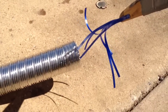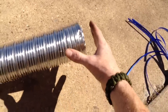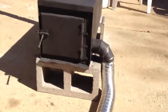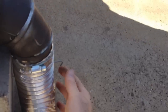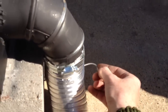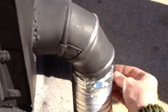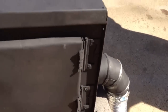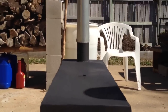There we go, a little bit. Let's see if I can feel it with my hand — yeah, you can definitely feel it. I mean, it's not going too fast, but it's sucking in air just a little bit. Now, here we got one problem: the top of the wood stove is smoking. That's not good. First thing we're going to do is come over here and shut our damper off. Cut a little bit of that air off. Y'all can't really see it, but it's definitely smoking. I'm going to cut this video off and we'll come back and see how it does in a few minutes.